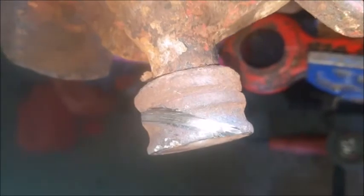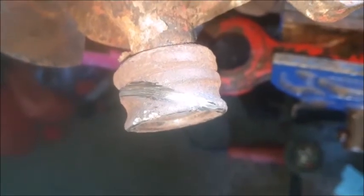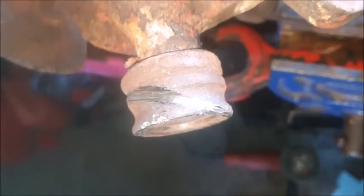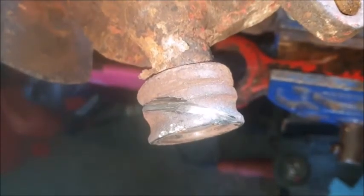You can see when I cooled it, it cracked along the cut line. I went pretty close but didn't score the shaft. Just nibble away until you think you're nearly there, then heat it up and cool it and it should pop. Just be careful — I gave it a few belts of the hammer. The bearing material is brittle, so make sure you have glasses on as bits will start flying at you.